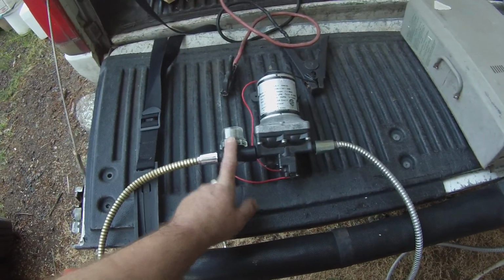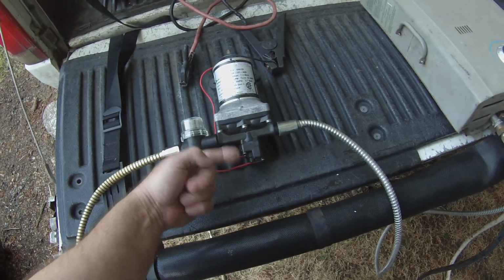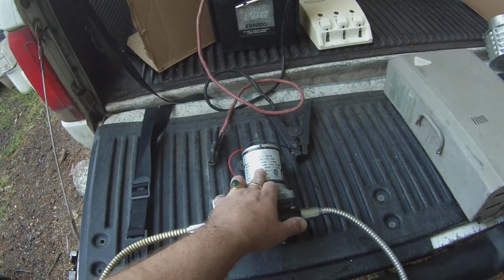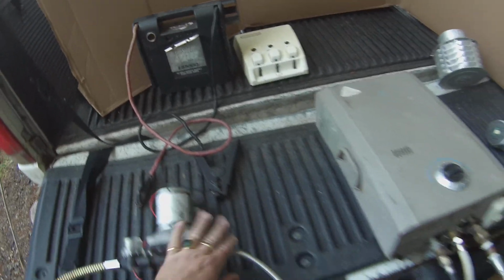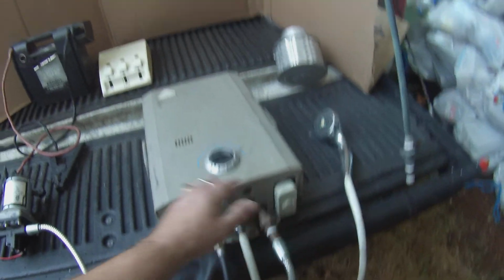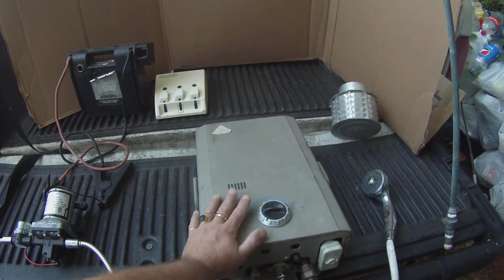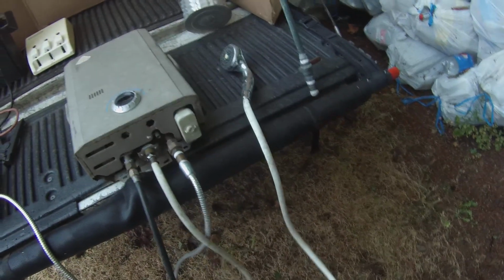You're going to need your water inlet, a SureFlow water filter. I would recommend getting the SureFlow. All your arrows have to match, of course, so your arrow points into your pump, and then again your arrow's pointing out of the pump. 3 gallon per minute pump minimum. Your battery pack, 12 volts, is going to run your pump. Then this runs into a 1/2 inch to 3/4 brass adapter that'll feed into where your water line goes into the water heater. EcoTemp L7 model minimum is what you should have to run the system. Water gets heated through the coil, comes back out and into your handset.